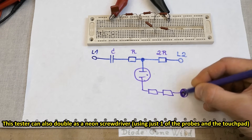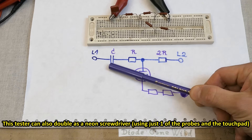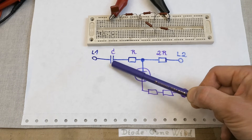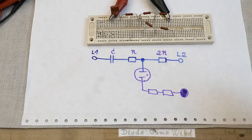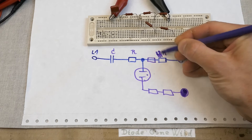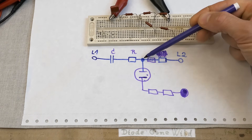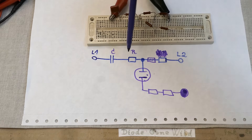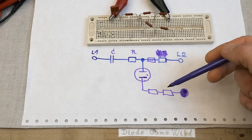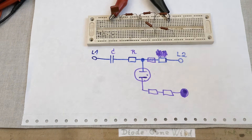Here's the touchpad. Here's the capacitor — one or several nanofarads. Here's the resistor based on the table: for 4.7 nF it's 390 kΩ, and the other resistor is twice the value. So if you want to build it from the same resistors, you can put two resistors in series there — which also makes sense because the voltage from phase to phase is double the voltage on one resistor. This reduces stress on the resistors, improves safety, and means all resistors can be the same value.